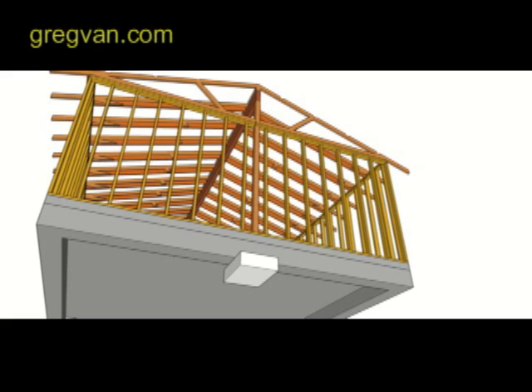As you can see with the pictures, the ridge beam will actually be supporting the rafters, and this would reduce or even eliminate the possibility of the walls spreading and possible collapse of the building.